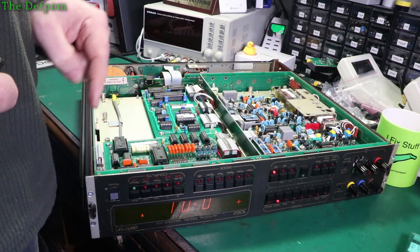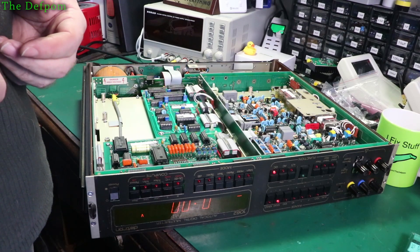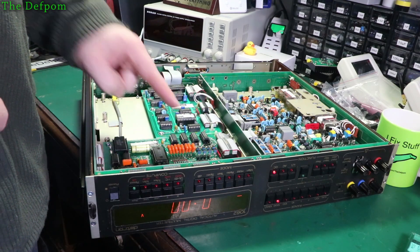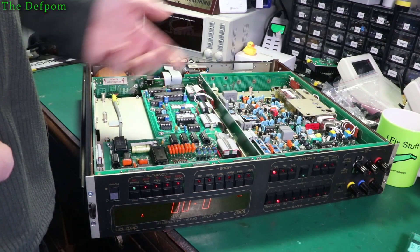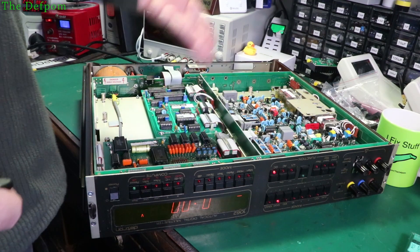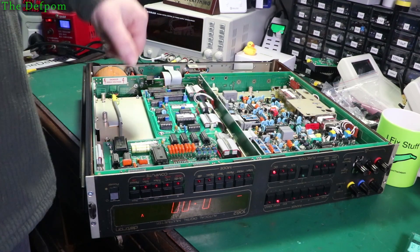...and the thing is in backwards! When I got it, the EEPROM was in backwards. So I've just been putting the thing back in the same way every time I took it out, thinking that was the correct way around. Turns out, no it wasn't. The board layout shows a notch at this end which means that's pin one, and the chip was in the other way around. So now it boots up. I don't know if it's dead but at least now it's correct. Unbelievable - who the hell did that? Someone's been taking chips out and putting them in backwards. Incredible.